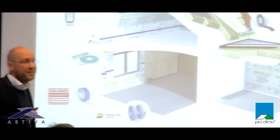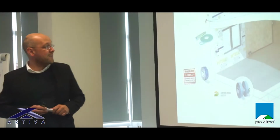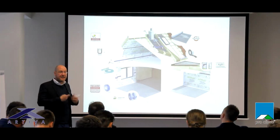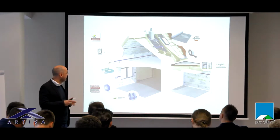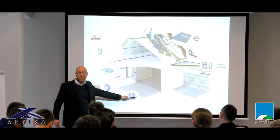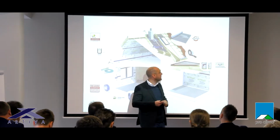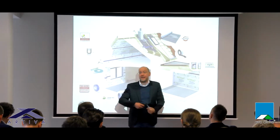When you take our assortment, or the assortment of every producer of airtightness materials, you see that they have tons of different solutions and tapes. For realizing real airtightness, a real airtight construction, when you're a good installer, you only need a tape, a glue, and a membrane. That's all. Then you can add some additional tapes for your help, some corner connection tapes, some grommets, or maybe a primer when you go into the refurbishment sector where you have a lot of dust and old materials which are not stable. Then you have to prime it. For a subroof membrane, you sometimes need a nail tightening tape.